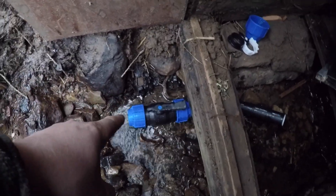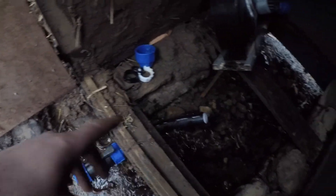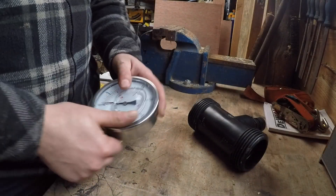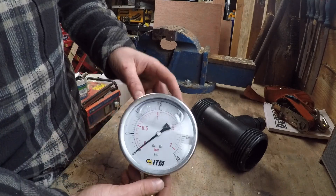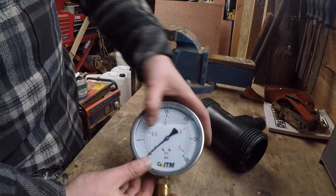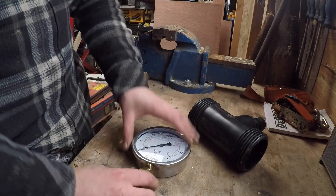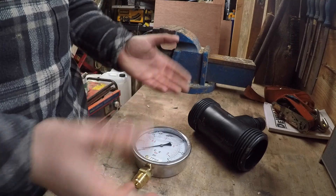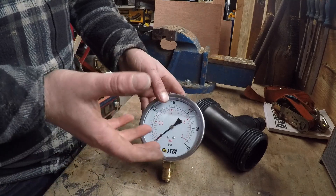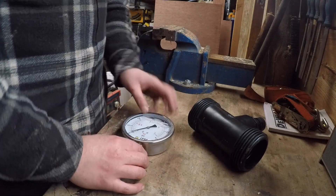It's going to sit right there. The rest of the pipe is going to go off underground up there. We're going to get this plumbing connected up and figure out where the turbine is going to go. Just had this nice pressure gauge turn up — it's perfectly within our pressure range. It's a nice big glycerin-filled pressure indicator, really important for hydroelectric because for diagnostics you can see how much pipe loss you've got — when the water is flowing, the decrease in pressure tells you how much loss you've got due to pipe friction.